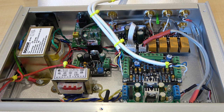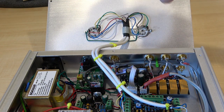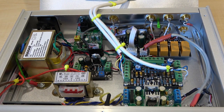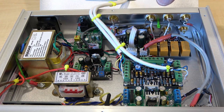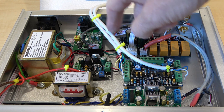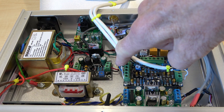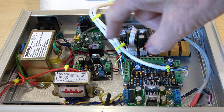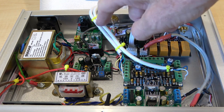This is an overview of the ingredients. If I zoom up slightly — this is the valve bases, and the whole thing just swivels out on this umbilical lead, which I have to change because it's a little bit too stiff. The effect is it doesn't go where I want it to when I shut the thing up, so I'm going to remove the sleeving and just use the wires tied together — same arrangement but the wires rather than the sleeving, because the sleeving is very stiff on this.